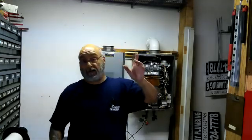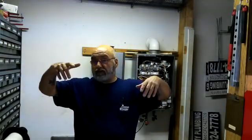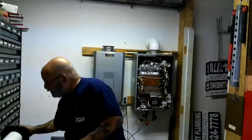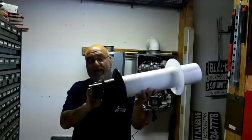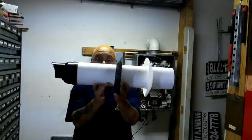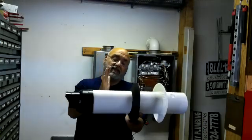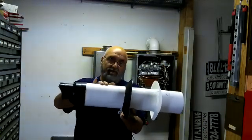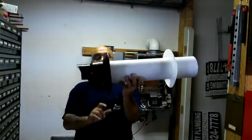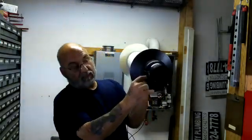That applies to the vertical vent going through the roof as well. When you put that through the boot or an existing boot, it goes down to a certain storm collar. The black is going to stay outside. The reason you want only the black to stick out of the house is because these are UV protected. If you have the white sticking out, unless you're going to paint it, it's going to look ugly and will become deteriorated from the sun. So when you push this in, you need to have only that much sticking out. This is paintable, but don't paint the thimble or the black vent head. Just don't get paint inside the fresh air inlet and the exhaust outlet.